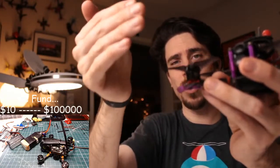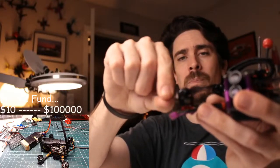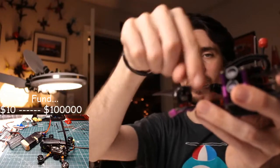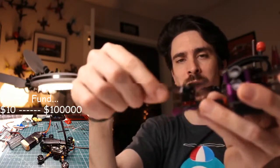And so when you put a duct, a physical barrier, right on the outside of the tip there, it prevents that from happening. It isolates the high and the low pressure zones, and it doesn't let them really mix. So you can just keep adding extra blades to the propeller, and you don't suffer such an efficiency loss.